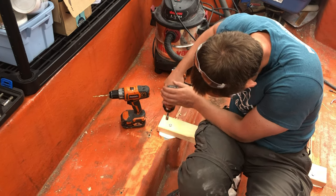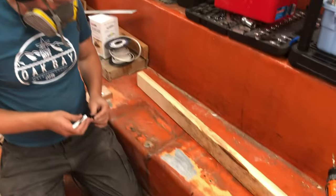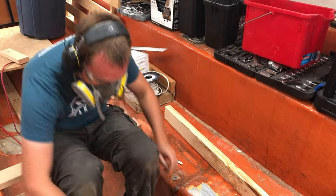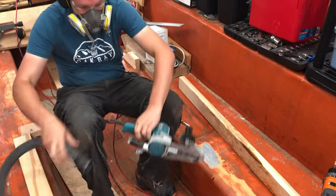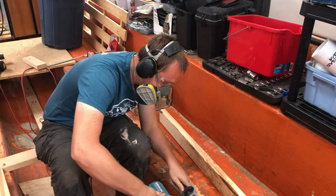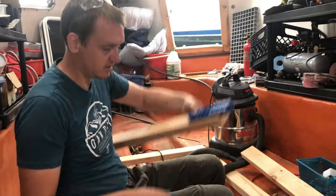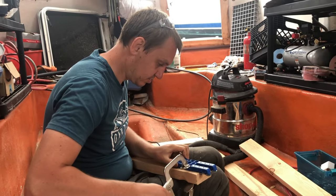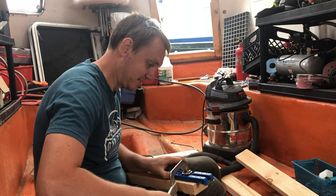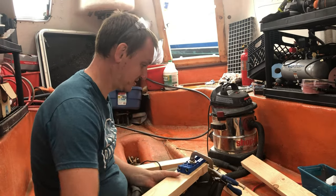Lightweight — you really need that in a trailer. In a racing boat, you would need that. Lots of boats, weight is a huge consideration. For us, we are so glad every single day that we are trying to add weight. We're trying to replace the weight of 60 people so that Luya sits a little bit better in the water. We have something like 11,000 pounds to get her to her specified sit-in-the-water weight. We won't add that much — we're trying to find a balance between weight, stability, and efficiency, especially being an electric engine. It's something we think about all the time.